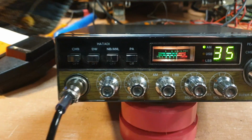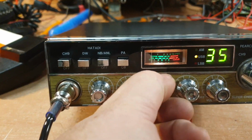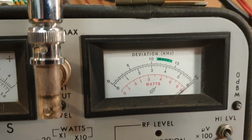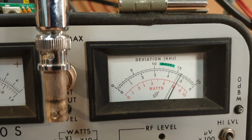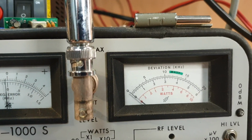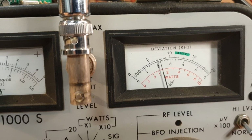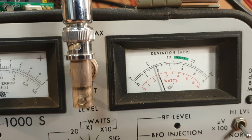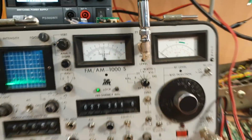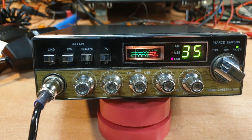What we'll do is we'll just shut up the noise there, which is a bit annoying after a while, and we'll go over to sideband and have a little bit of a look. And what do we got? Hello 1 2 3, hello 1 2, hello 1 2. Well, that's a 10 watt scale there, so that's not looking too bad actually. Probably a little bit over 10 watts. And hello, pretty stock standard actually. Hello audio, 12 to 13 watts I'd say. So it's sounding quite nice, and they're not a bad little set.